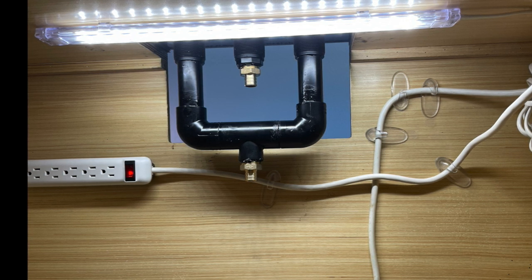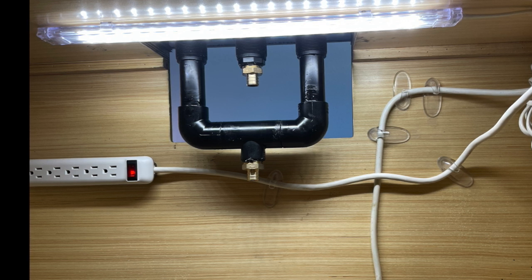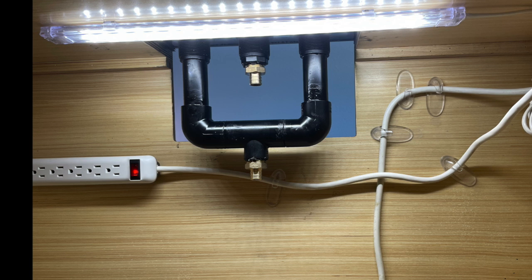So once you put the silicone on there and you screw it in, once you feel enough resistance, stop. You'll still maybe have some threads showing, but that is okay. Let that dry up and you'll be good to go without any leaks. In fact, after I installed everything here, I had 0 leaks. Nothing was even leaking at all.